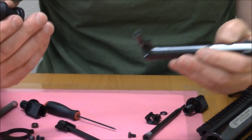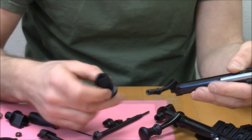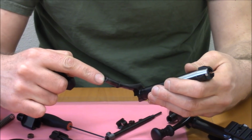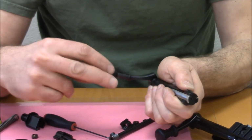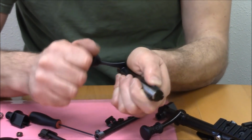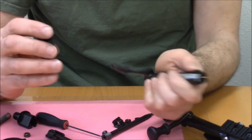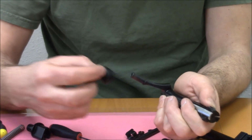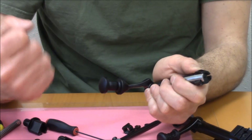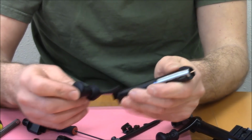That's not a bolt knob. This is a bolt knob. And here's another bolt knob. And we have a couple other types too that I'll get up on the website pretty soon. But this spindle is .315 in diameter. There's a 10-32 tapped hole in here. Bolt knobs just screw on. And the thing I like about this design is that there's a steel shank basically running through the knob. The screw's way back in here, so you can stomp on this knob if you get a case really stuck tight, and sometimes the heel of the boot is required to cycle the action with a stubbornly stuck load.